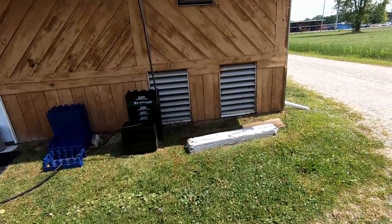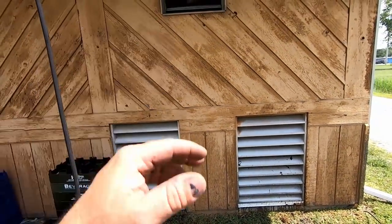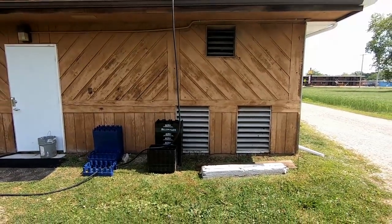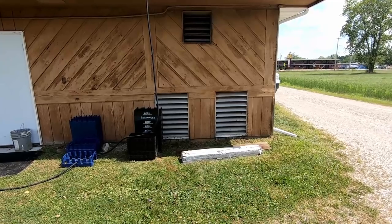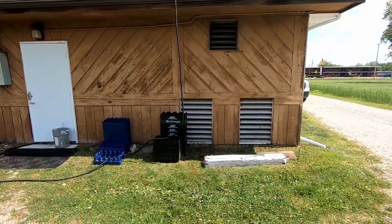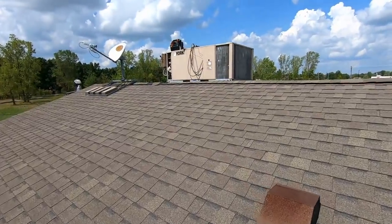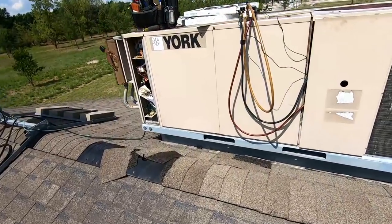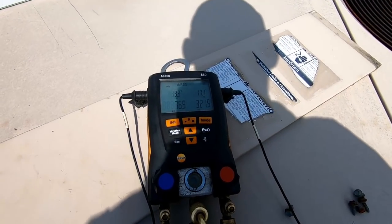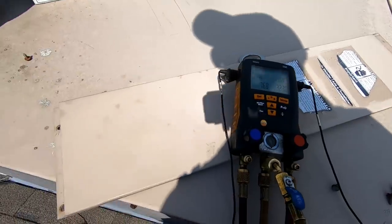These things are full solid so we're going to clean those off real quick too. I went ahead and washed those out — sprayed them out to knock all that dirt out. It's not what I'm here for, but I'll be on call and this is a potential call I'll have to get, and it never fails — it happens at nighttime. So I'm just going to do it while I'm here. They do this in northern climates to control ambient temperatures when it gets colder out. Suction pressure is looking a little better — we're bringing that temperature down. Superheat is 13-17, down to 77-ish.